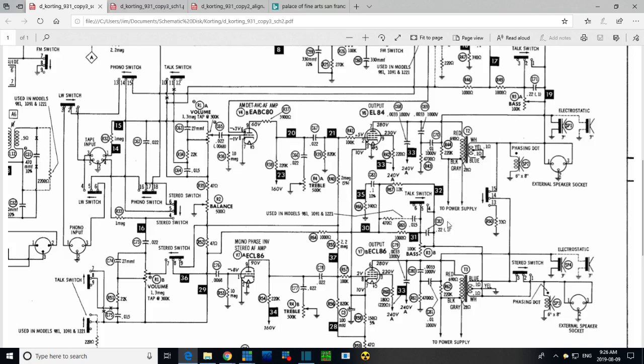So that raises another interesting question. Oh yeah, the resistor. First thing I've got to show you is the resistor. So here it is, R43, 4700 ohms, tied right between where two of these 1000 volt capacitors connect, one of which, as I said before, is gooped out, this one. Ground is found on the far side of this resistor.